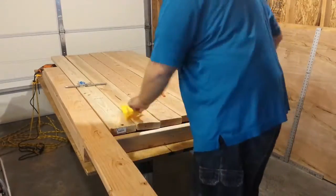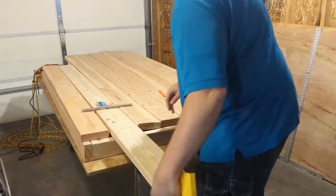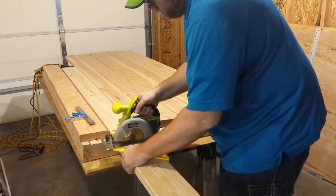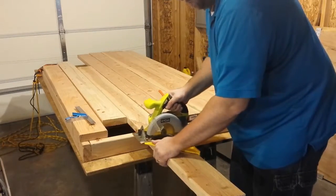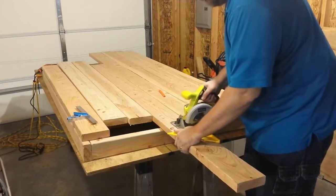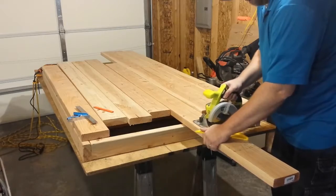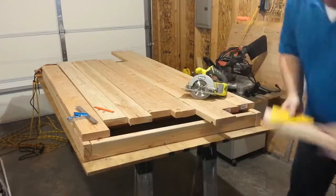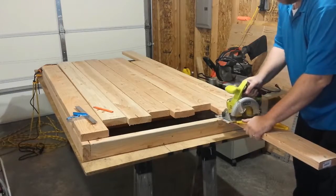This ended up having a lot of repetition to each piece. I'm using my speed square as a guide for the circular saw, lining everything up and then holding the speed square tight to run the edge of the saw's guard along it to make sure I stay straight on the line. I want to make these as square cuts as possible, and having measured really well to begin with, this part is just zip, zip, zip — each one quickly, but with a lot of repetition.